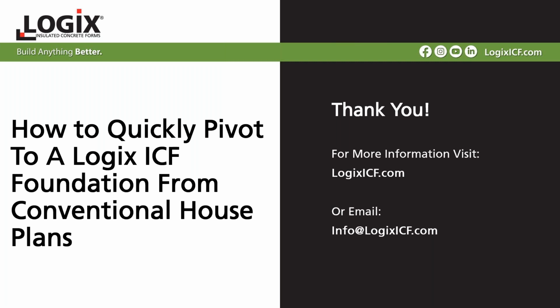We have a question, and I'm not sure if it should be Win or Francis handling this, and it may be a complicated question. This is from Mary Elise, and she'd like to know, are there any issues with a daylighted foundation having walls changing sizes? For instance, if she were to have west, north, and east foundation walls with 8-inch ICF and a south wall of 6-inch ICF. Do you understand that question, Francis? I think so. Win can correct me if I'm not right, but basically you're looking at changing your wall size as you transition horizontally. If that is the case, we actually do have details on how to do that and how to support it during construction. And we could provide you CAD drawings if you need it for your design as well.